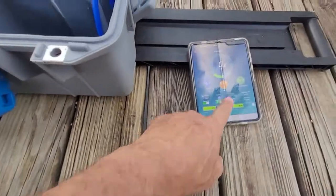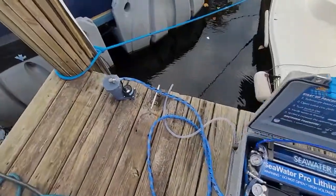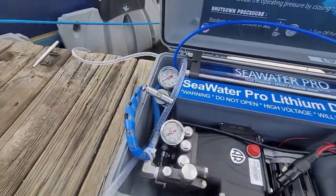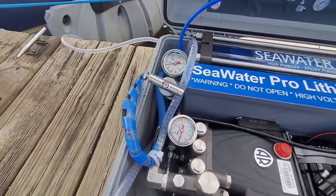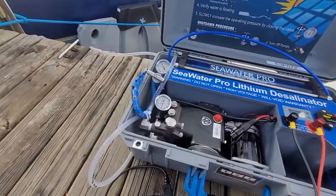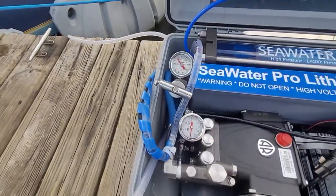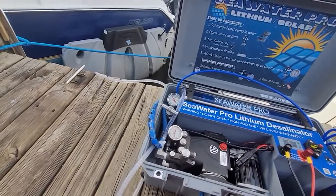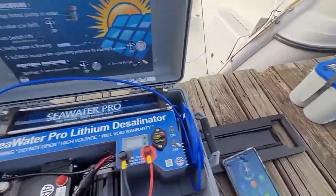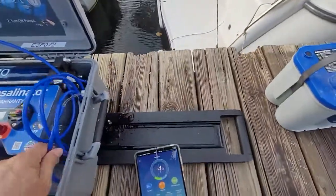There are a couple of ways of turning it on. You can flip this switch here or you can power it on from here. All we have to do is drop the boost pump in the water and it will self-prime. The pressure is already dialed for 600 psi — it will self-prime and go to the desired pressure, exactly what you left it last time. The unit also has our patented pressure regulator. It is not a needle valve — this is a much more sophisticated way of maintaining pressure. And right now we're running off the battery because the device is not connected to the AC adapter or anything else. Here's the fresh water.